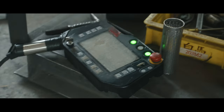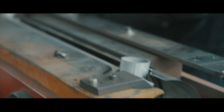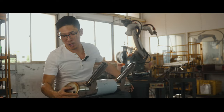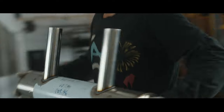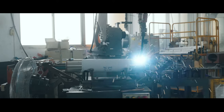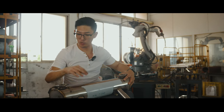To start off, the muffler can is made of stainless steel sheet metal that we roll first, and then we use a MIG machine — the one behind me — which welds the muffler can, the side caps on both sides, and also the main weld to keep the sheet metal together.